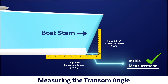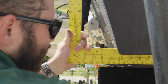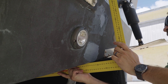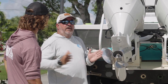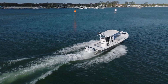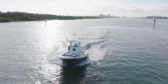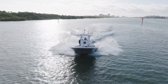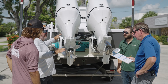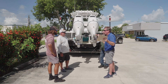Armstrong maintains 16 degrees on the motor plate, giving it more tuck and better performance. A typical transom angle kicks back somewhat, providing a little negative trim to the motor. Adding extra angle buys more negative trim. Adam's bow is a little light and he struggles to get the boat on plane — adding negative trim to the bracket lifts the transom and puts the bow down without needing trim tabs, giving quicker planing and better speed.